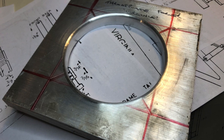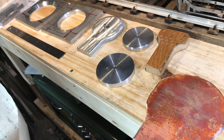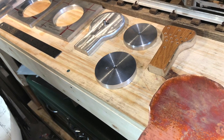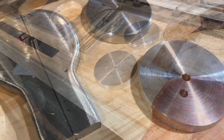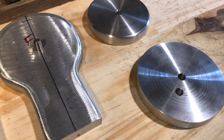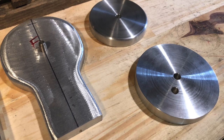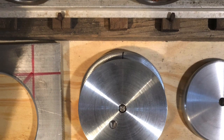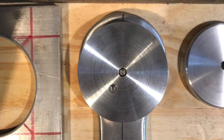Once I had those complete I had a back plate and a forming plate. I also made a centre plug. I also made a backhead former where I cut that by freehand and then used an angle grinder with a sanding disc to get the radius - that took a little while going carefully but worked out well. I put a little pin in the centre to locate the former for the tube and for the throat plate, and in some further images that becomes evident how that works.